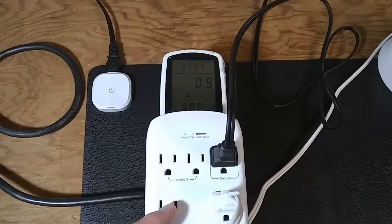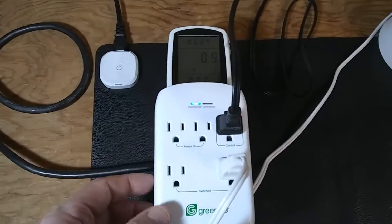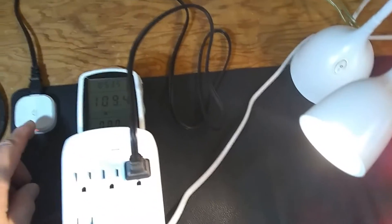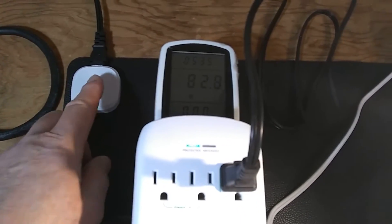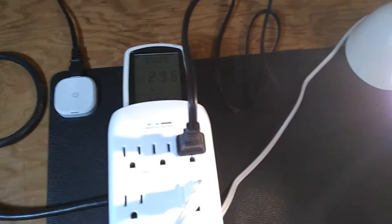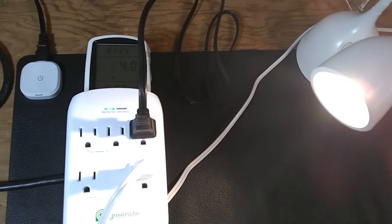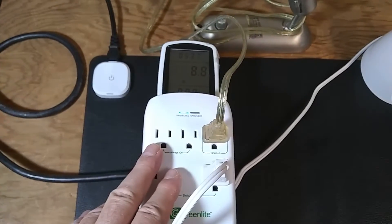Now this is the 5-outlet advanced power strip with more sophisticated electronics — I'll link my video from two months ago in the description. Connecting the same problematic heating mat to the control outlet of this strip and turning it to full power, the control light comes on right away. At medium setting, 82.7 watts — no problem. At the lowest setting, 56.4 watts. Turning it off, this unit has about an 8-second delay, but there's no clicking, no frenzy, no problem whatsoever. It works perfectly and is much more stable.